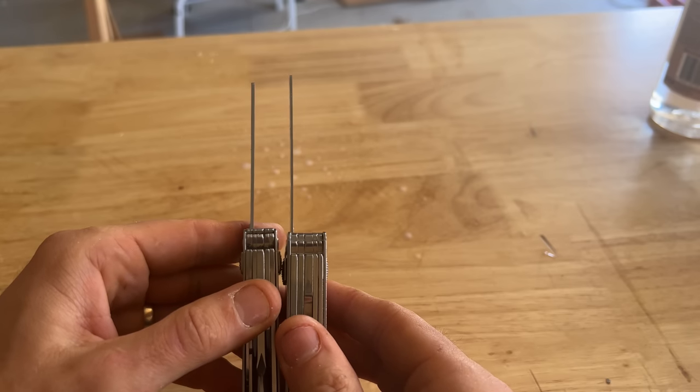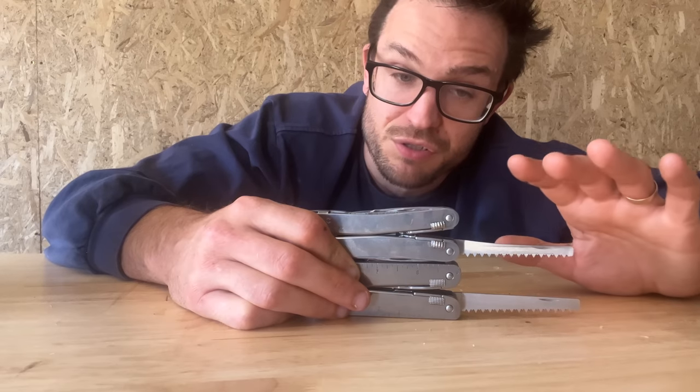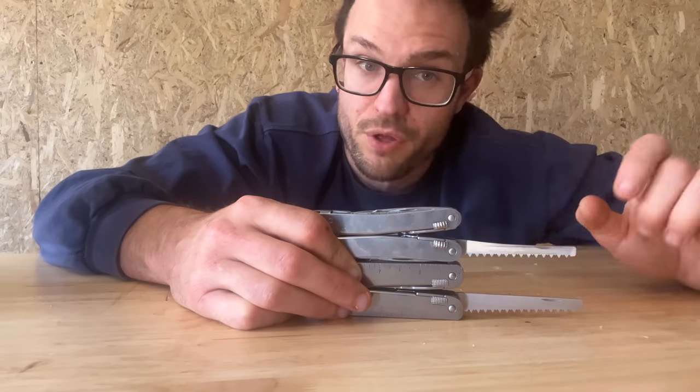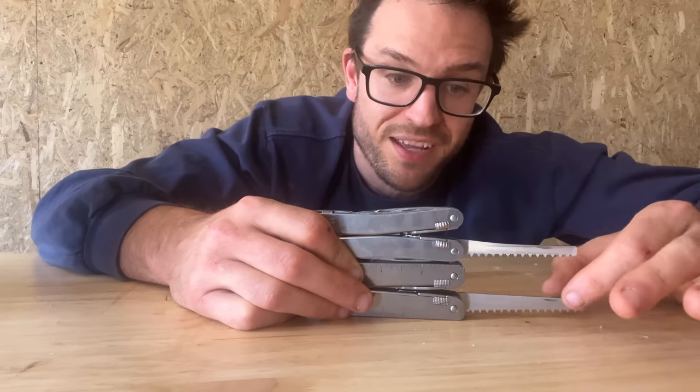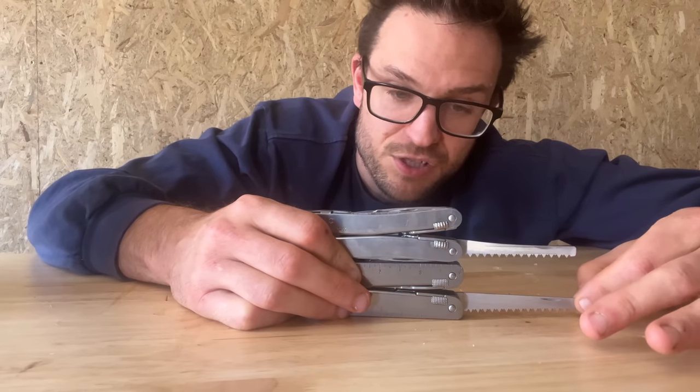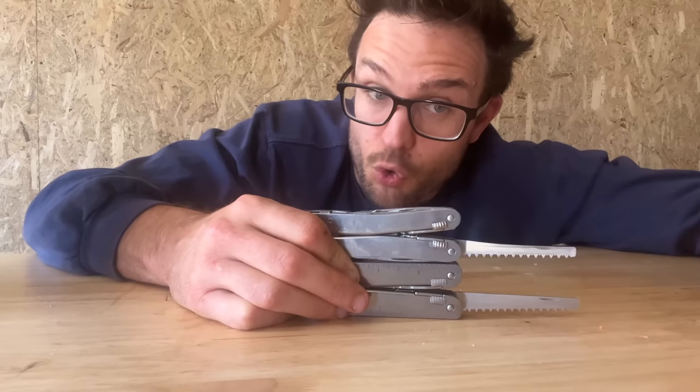So a good saw has teeth that are at least sort of a third thicker than the spine. So the spine should be, you know, only two thirds the thickness of it at the teeth. And that can really be done quite easily. And this one really glides through on the Swisstool, given that it is a slightly taller saw.